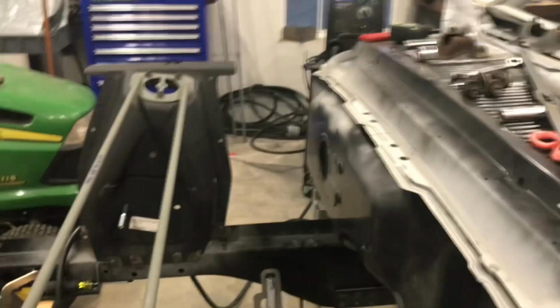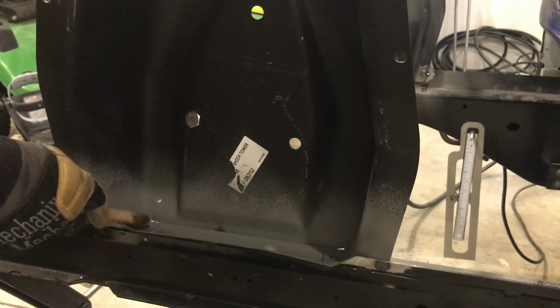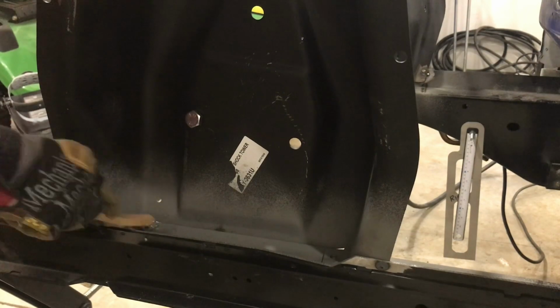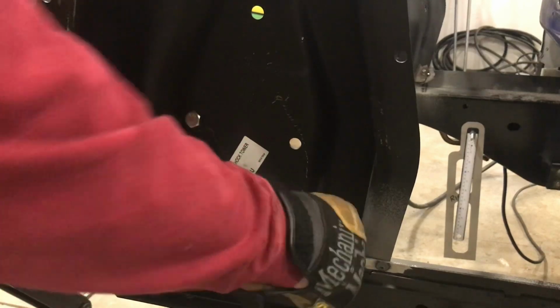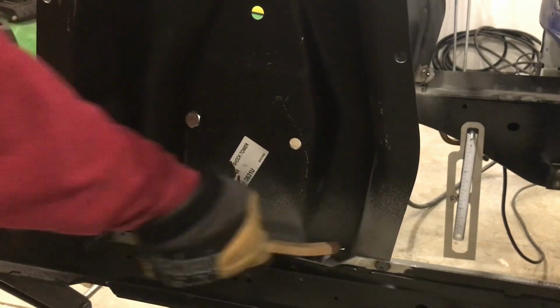All right, what I'm trying to do is go a little lower. I'm trying to prep these spots in here, so I have to get the weld-through primer off some of those areas that are exposed. Otherwise, it's going to weld like royal crap. The weld-through primer is really only supposed to be a barrier around the welds underneath the metal, not really through the weld. That's why it spits and sputters sometimes when you burn into that stuff. It really just doesn't like it.